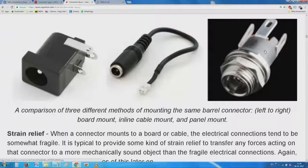That often causes the other end to completely fail. The only other way of getting over it is to make a D-type thing. So some of these, especially BNC, have a D-type cut here. So when you push it inside, the D is supposed to prevent rotation, but due to small variations in manufacturing tolerances, the D opening can be a little bigger and the connector can be a little smaller. You end up with an unpleasant situation where first damage starts and eventually it will start rotating.